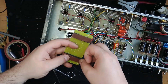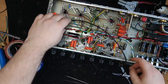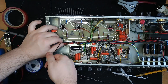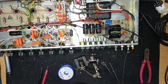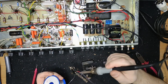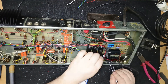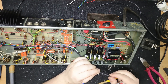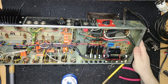Very strong double-sided tape is used to mount the board to the chassis. Now to prep the front switch. On one side, the pins need to be jumpered so when the switch is in the off position, the signal goes straight from preamp to power amp. Another shielded cable is added to carry the signal between the switch and the preamp and power amp junction. The GEQ input and output wires go to the other side of the switch. The shielding is trimmed and insulation is added to keep it tidy and secure. That shielding is grounded on the other side of the cable via the driver board.